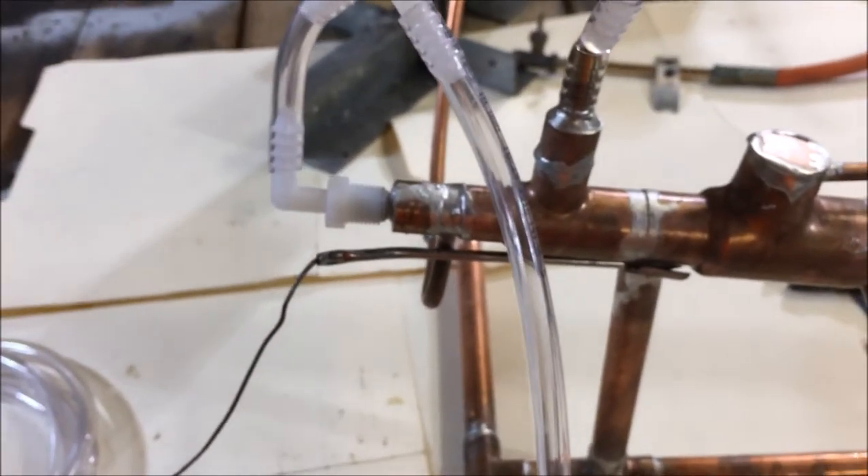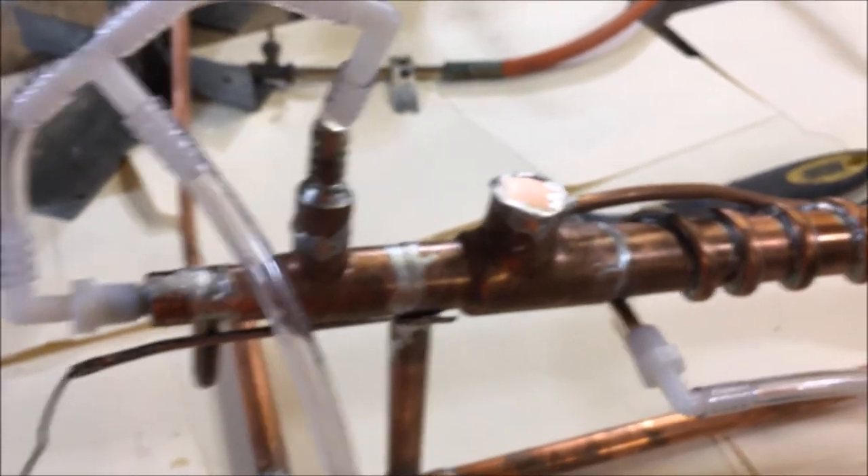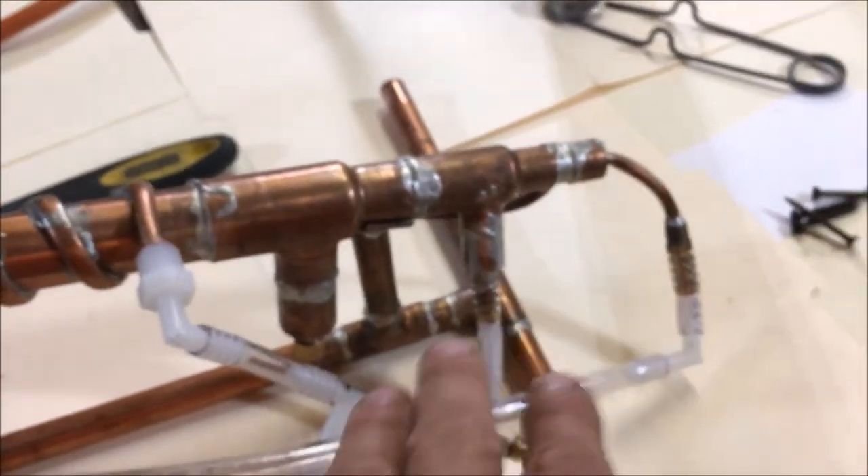This thing is also set up in a co-flow configuration where the coldest water enters first — that ensures the maximum amount of condensation. Counter-flow makes your condensate come out a lot cooler, but you waste a lot of your cooling energy by cooling down the condensate rather than condensing steam. So whenever efficiency is of any importance, remember to hook it up in a co-flow configuration that exposes the steam to the coldest portion of the condenser. Otherwise you're just cooling down your condensate to temperatures far cooler than necessary.